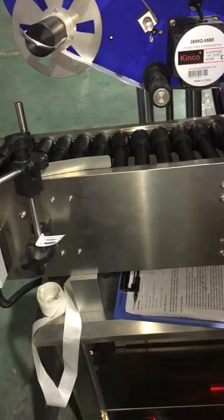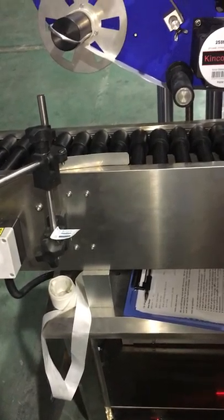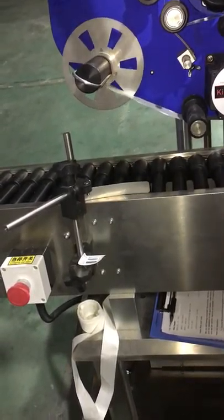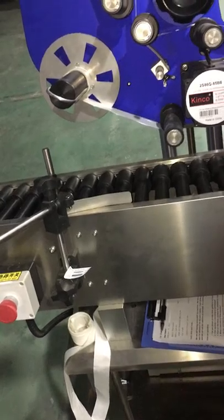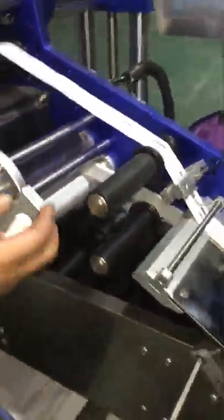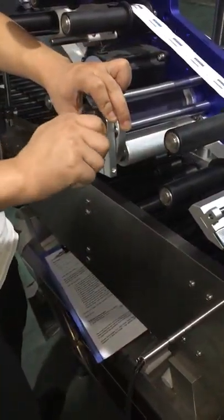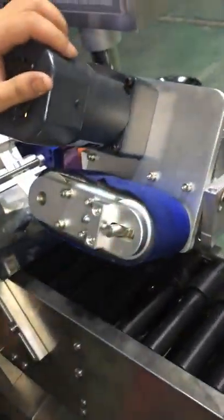So we get a middle one of 3655. If our setting is not larger than the maximum value, it will cause continuous labeling. The value must be larger than the highest value on the label, not smaller. So anyway, the index we set must be a little bigger than the highest index on the label. Then we lock this ruler and try, and put it down.